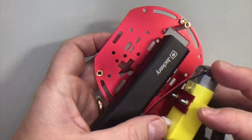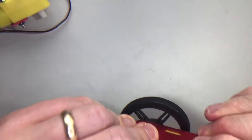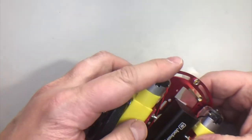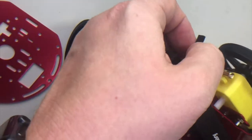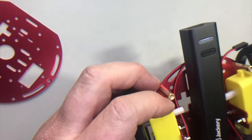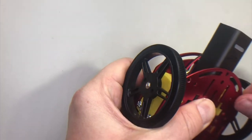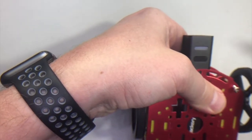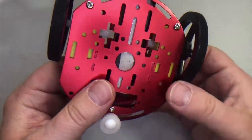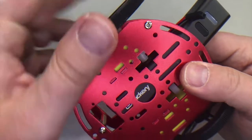Now we're going to create a motor and battery sandwich between the two mounting plates of our chassis. Position each motor so that the cap where the wires come out is facing closest to the front ball wheel. This is probably the most challenging piece — most of the time all the parts line up, but sometimes things are a little off. There are two slots on each chassis plate that should line up with the slots poking out from the mounting plates on the two motors. Press them in hard once everything is lined up, then put on the top plate. You may need to jiggle the brass standoffs to get the final screws in. Make sure your sandwich is all in there, the motors are snug, and the pins are in the right place.